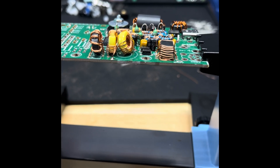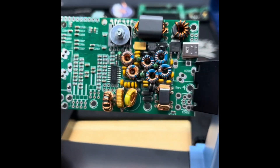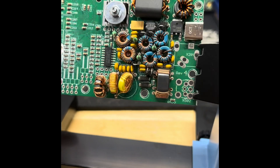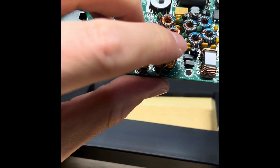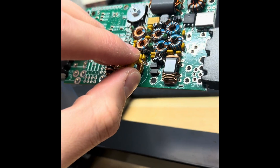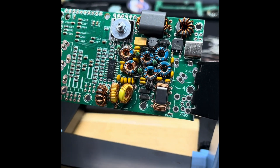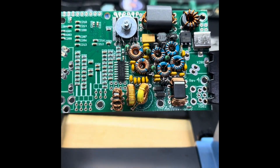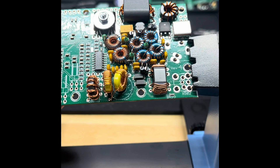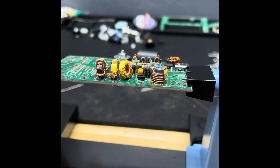This QMX mid-band was delivered earlier today and I'm really flying on it. I'm definitely doing a better job with my solder joints than I did in my first build. I'm a little worried about this toroid - I didn't get it perpendicular to the board, I don't know if that matters. But I have all the toroids wound, and now I'm on to the easy part of the build. It's going to get pretty easy from here. I may finish it tonight. The big question is going to be: will it power on when I finish the build?